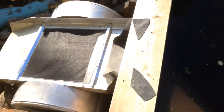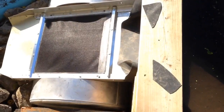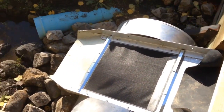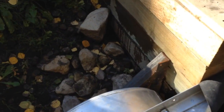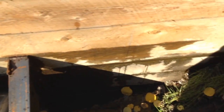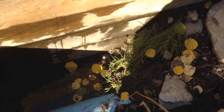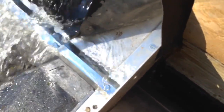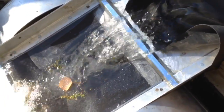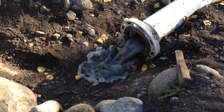A temporary piece of window screen is installed to prevent any debris from entering our tank. You can see the flow through the standpipe has ceased. As the water rises we find some leakage around the edges of the weir. During this testing this is not of consequence, and we will determine the best way to seal it water tight when we commission the system. The great majority of the water is entering the intake, and we finally have our first water.